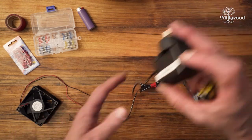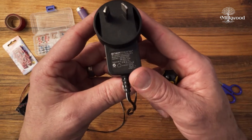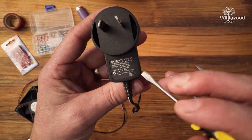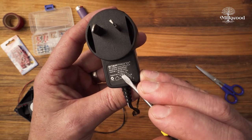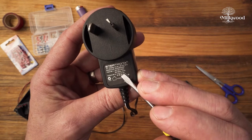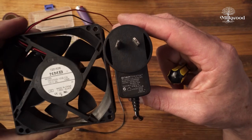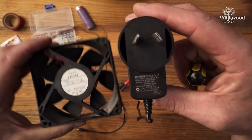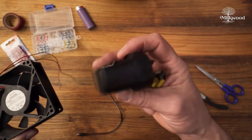Let's have a look at this one. It says 12 volt DC — the line with the dots underneath it — and it says one amp, so that's 1000 milliamps. Remember our fan only required 0.92 of an amp. So this one can provide enough power, even though it's much smaller. It's a modern switch mode power supply.